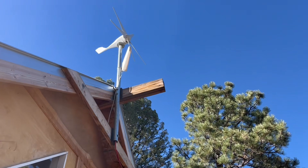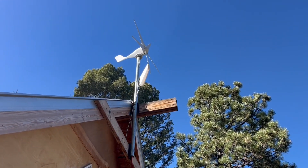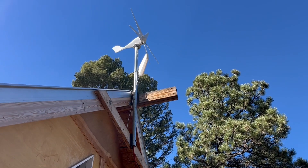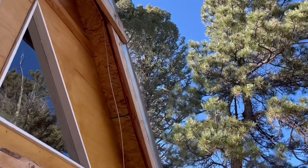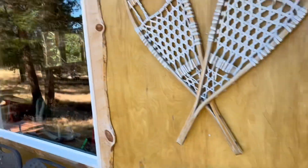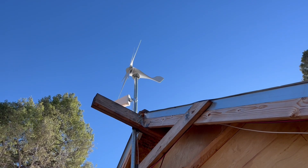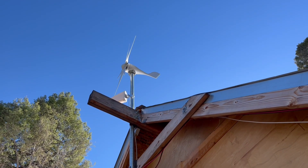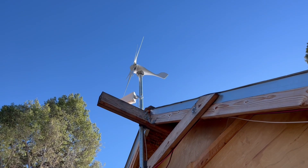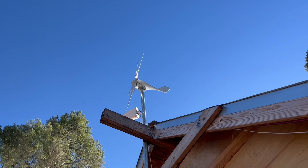There's my Dyna Living 500-watt wind generator. I put it up on a pole, and we get quite a bit of wind here in the wintertime — that thing will get humming pretty good. It uses three 8-gauge wires coming out of it, and you can see I run them down the side of the house, under the house and back up to where the charge controller is. The interesting thing is that wind generators only generate AC power, so it has to convert AC to DC, drop it into the batteries, the batteries kick it out to the inverter, and the inverter creates it back to AC. It seems redundant, but you have to protect the system and make sure you're not overcharging batteries or burning up wires with too much power.